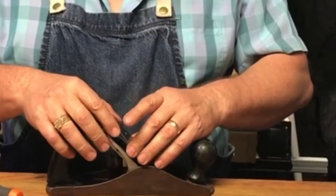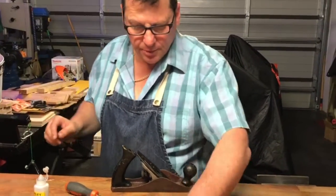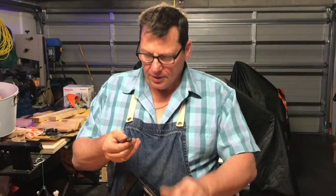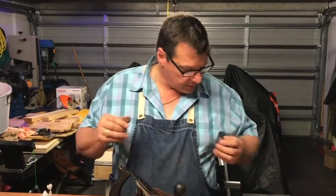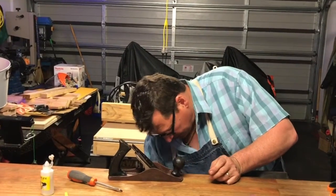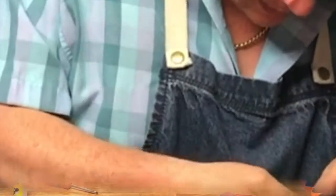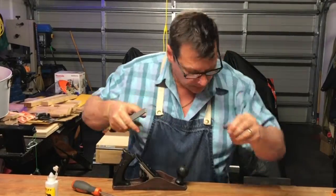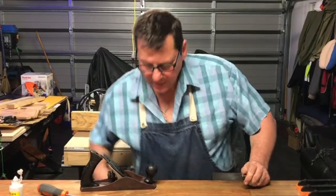So it now sits back in here. The other reason I think this is a bits-and-pieces unit is because this screw doesn't actually fit through that hole. It's not far away, so I think it's a burr on here. I might just file that so I don't have any problems with it — just take those burrs off. Can you see that burr there? It's like a little raised bit — that's what's stopping it going through. I'll just wedge it in there; that should fit through nicely.